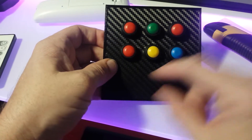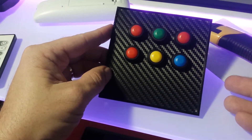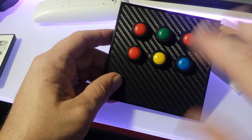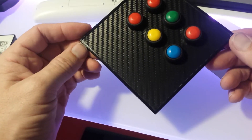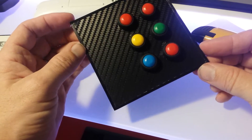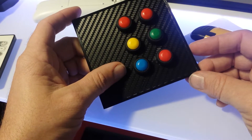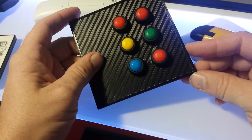You can put toggle switches on here, you can put an LCD in here, you can do pretty much anything you want. With a set of standard sizes, you can pretty much design and forward plan your cockpit and just print these out as you need them. If you want a couple of buttons, you just create some Google SketchUp holes and 3D print it. At two millimeters thick, according to Cura, this cost about 77 cents to print. The actual box enclosures I've done in the past have been upwards of $14 to $15 just for the plastic enclosure, not including the hour and a half it takes to create the template, place it on, pre-drill, drill all the holes, clean out the holes and then start mounting the equipment.